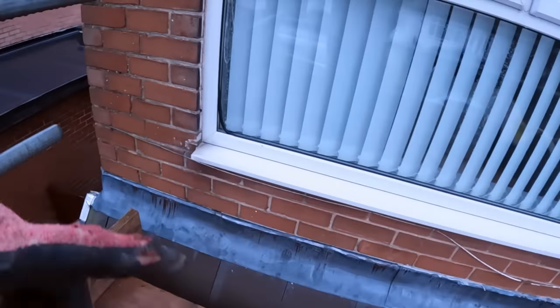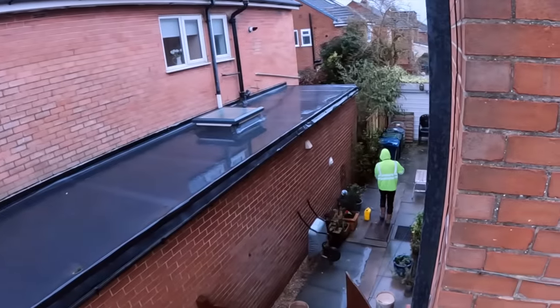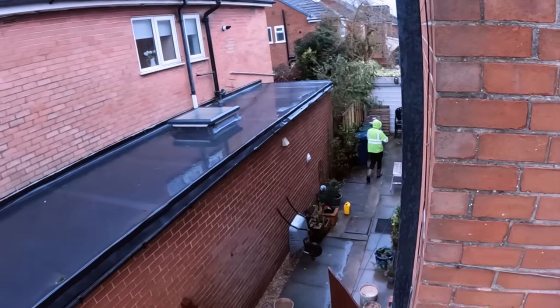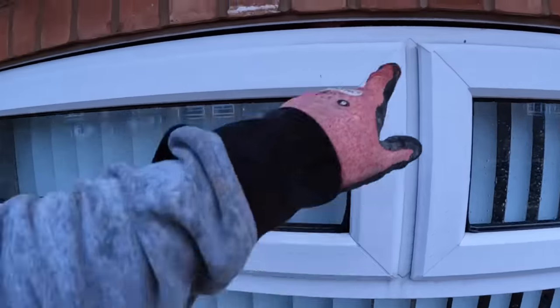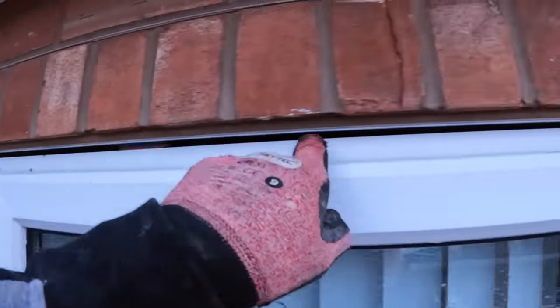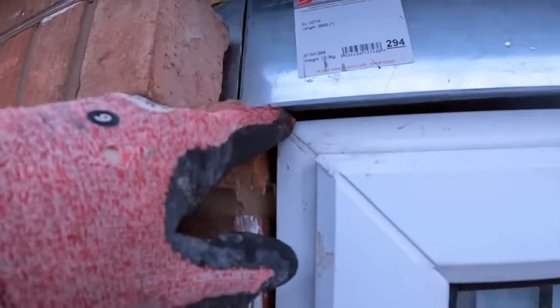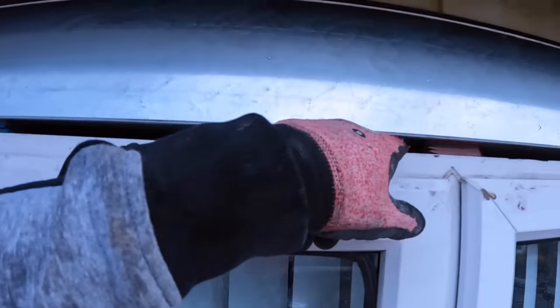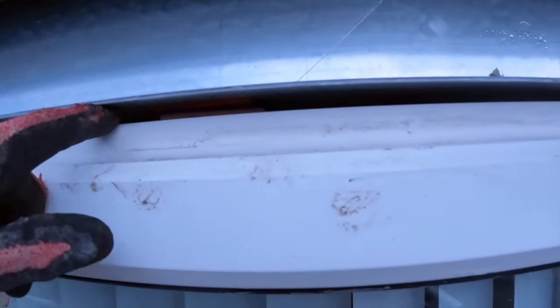That's us. As I explained before, the trim's too small, so we're back in the area tomorrow, so we'll come and get that trim on finally. We'll go and buy some 50mm. So yeah, this could probably be sealed because it's down like 5mm, down to 10, back to 5mm, but this one can't. You've got almost 10mm there, up through to about 20 in the middle, back to about 10 at this end. That's got a bit of an overhang lip, so the gap's bigger than it looks.